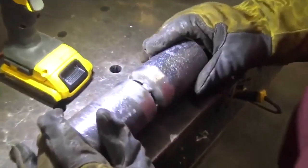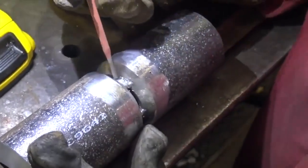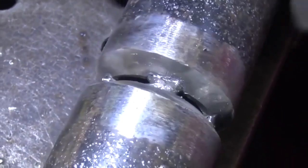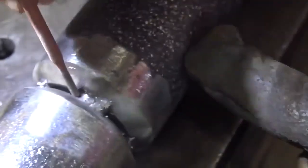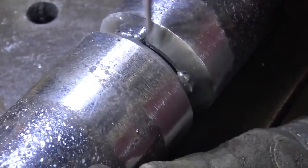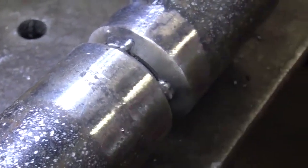Do you see how this side has a keyhole? That's a term for where your weld can tie back in — just like a key fits in a lock, it's going to tie back in when you come back around. But this side does not have a keyhole. So we're going to take the cut disc and do a technique called feathering — take the edge of the disc and feather back and forth to emulate an actual keyhole wherever we don't have one, so our weld can tie in all the way through.